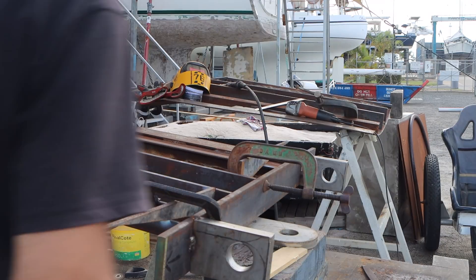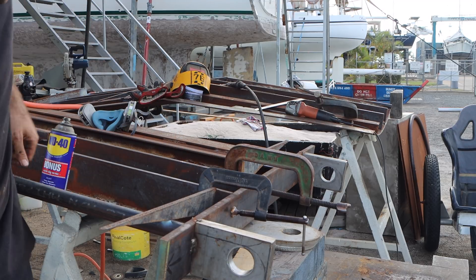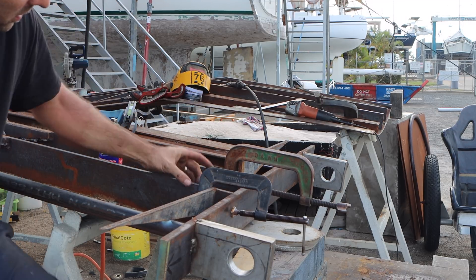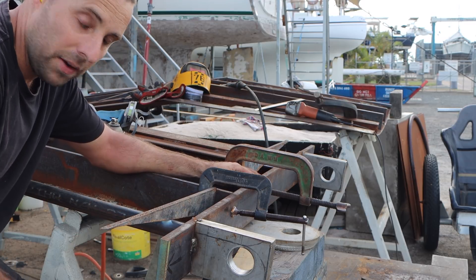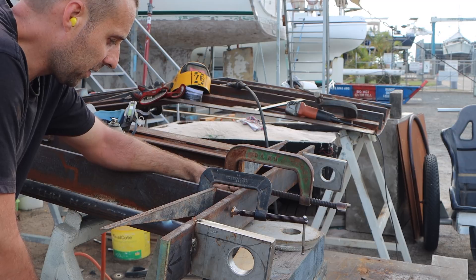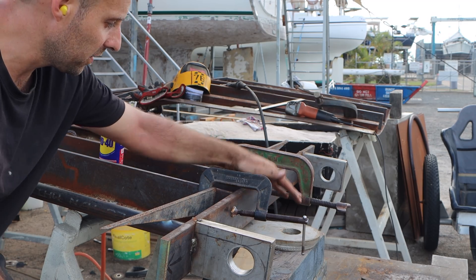The alignment's horrible, but we're kind of getting there. What I'm trying to do is get this surface flush and this surface flush. These pieces of steel are all the same dimensions — 16mm by 100mm — so I'm going to use that as my guide and basically weld the skin to whatever is left. These are the important bits because these take the strain. The skin, yes, it takes strain, but it's nowhere near as much as what this internal structure is going to be — so this is the bit that has to work.